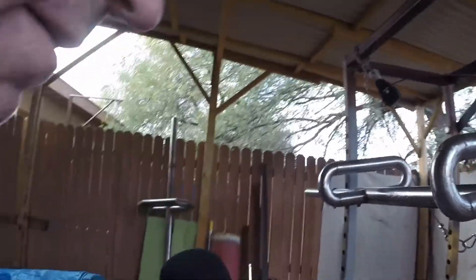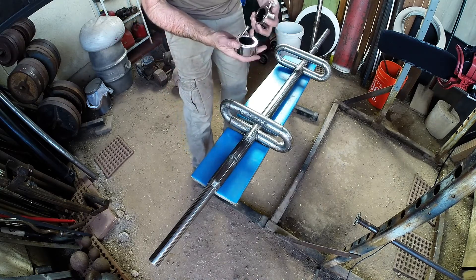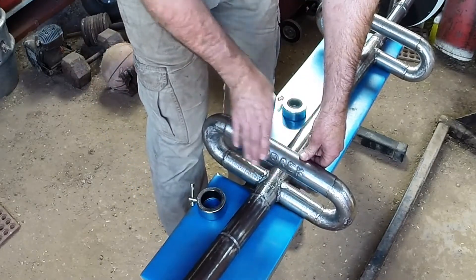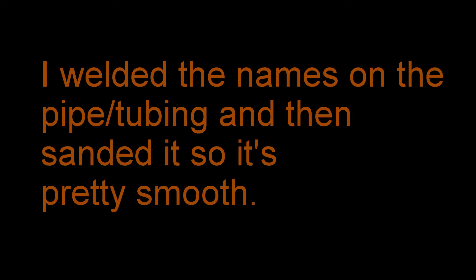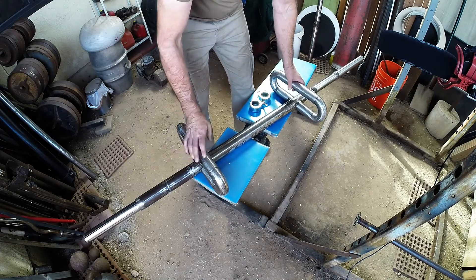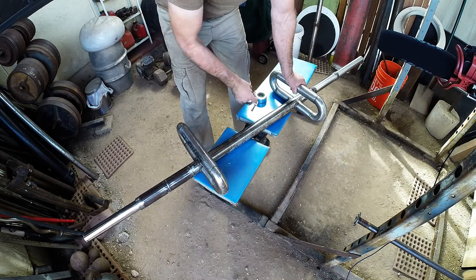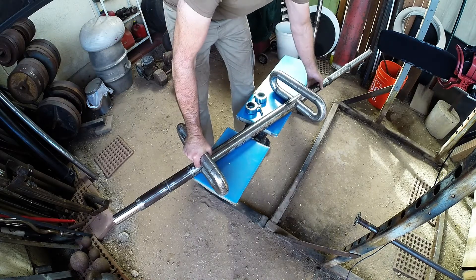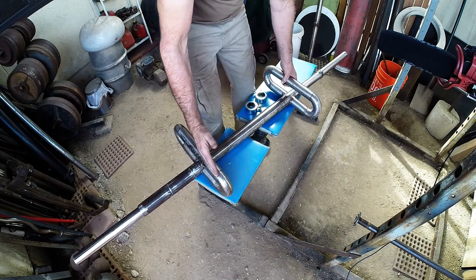So I'll show you some different ways you can configure this thing. Again, I apologize for being so grubby — I've just been working on this thing and I wanted to get it to Dan John. So these are Ivanko collars I got for you. I know these will work with this bar. My name on the side doesn't cause any roughness. So the way I designed this is you slide this onto your pipe — the easiest way is just put your handles on the ground or stand it up. This thing weighs about 43 and a half pounds altogether. The collars are about a pound each, so with collars on it'll be about 45 pounds, which is the approximate weight of an Olympic barbell. You just slide this in here until it hits the collar — put the short end on this inner collar and that centers your handle exactly where you want it.